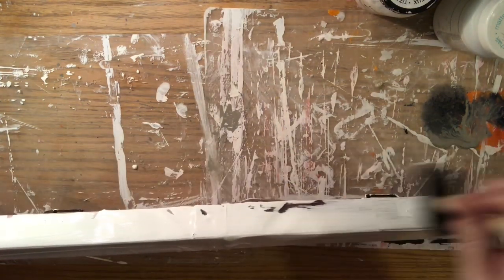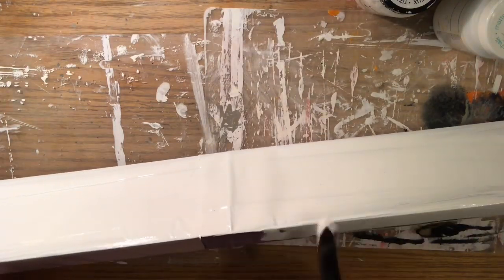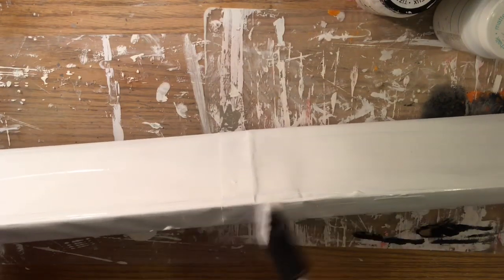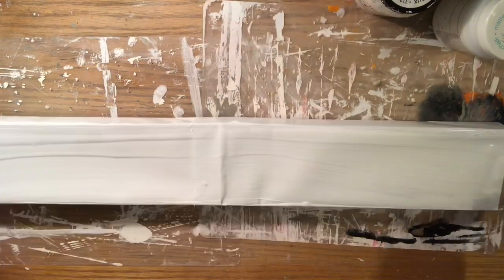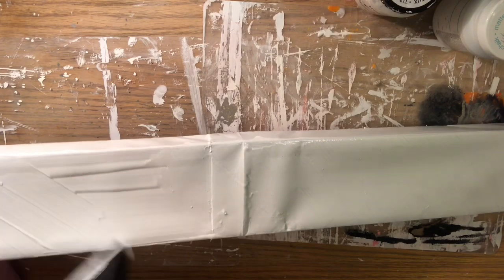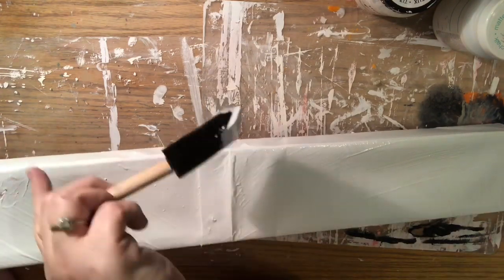I've decided to just go with the Waverly white chalk paint that I have a ton of now and put one nice thick coat on it. I will tell you though, if you don't let your Mod Podge dry, or if you put the paint too thick of a coat on top of the Mod Podge, it will create a crackle finish. If that's the look you're after, go for it. If not, just be mindful of those two tips.